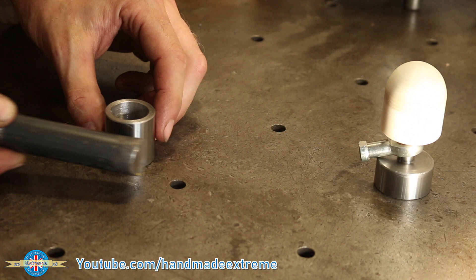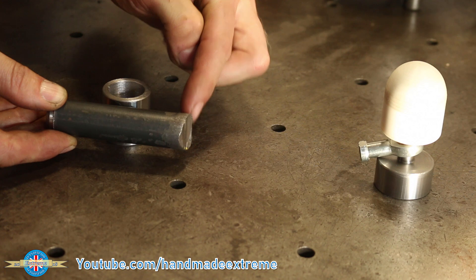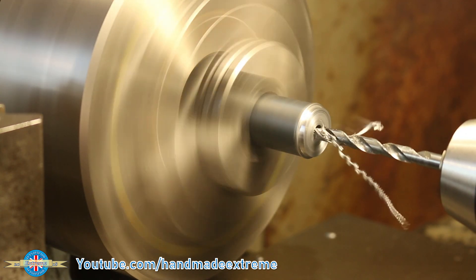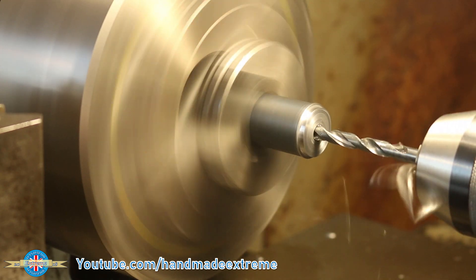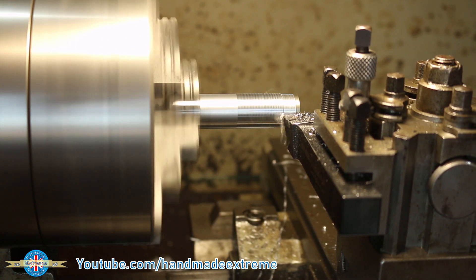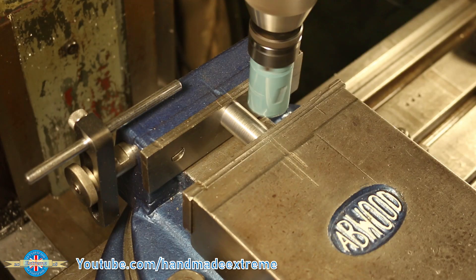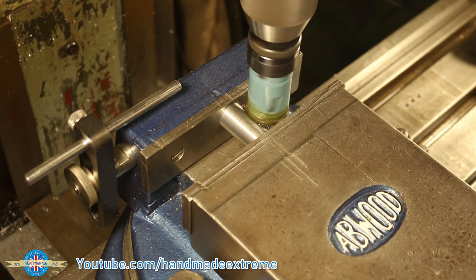Next I need to make a little piece that will attach to the holder. There's going to be a piece of threaded rod that goes between this piece and the base, which will set the distance for the cutter to the centre of the circle. The threaded rod will be 6mm in diameter, so I drilled a 6.5mm hole through the centre of this part to give it clearance on the rod. I then turned the outside diameter down — a much smaller cut here as I've got a lot of stick out of the chuck. Over to the mill now. To make sure I had a nice fit up between this part and the part that goes around the plasma cutter head, I used a 32mm hole saw to notch out some material.